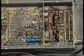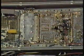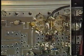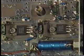The first stage is on the right. The output coupler is on the left, and provides a sample for the AGC circuits, which are also contained in this module, but are described in a separate subsection. The variable capacitors around the transistor stages are adjusted for optimum response over the whole UHF band. Three terminal regulators are used, which sense the collector current of the RF transistors and stabilize their bias conditions by varying their base currents.